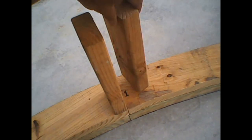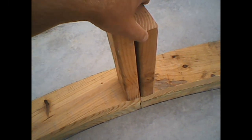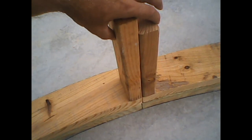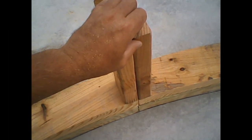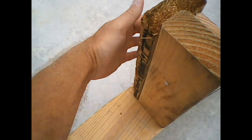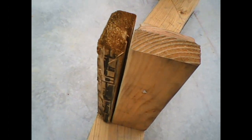Basically, on each end of the segment we're going to have a 2x4. Those 2x4s are going to sit against each other and be nailed together. That's going to make the rigid support for the staircase. And then on the outside of that whole sandwich, we're going to nail on another 2x4, so it ties those 2x4s together as well as finishes up that sandwich.